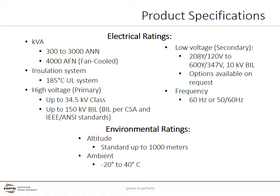The low voltage secondary is commonly designed for 208, 480, or 600 volt Y connections at 10 kV BIL, although other voltages and BILs can be accommodated. Common frequencies are 60 Hz or 50 and 60 Hz. The Endurocoil E is rated for a standard altitude of up to 1000 meters; designs above this altitude will be derated to accommodate the lower cooling ability and lower dielectric strength at higher altitudes. The units are rated for ambient temperatures of minus 20 to positive 40 degrees Celsius, with temperatures up to 60 degrees Celsius and lower than minus 20 degrees Celsius available upon request.